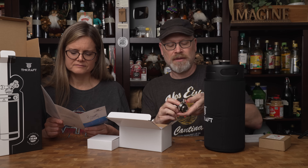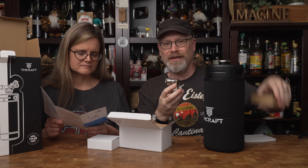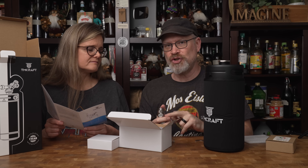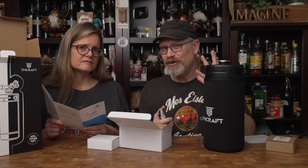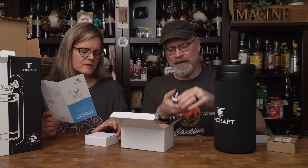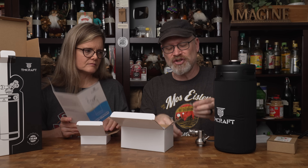This is the main central part. When you take this off, you screw this into here. The pressure regulator screws on here, and over here is the pressure release valve — that's really important. It is an automatic pressure release valve: if pressure gets too high, this will release it. It's not regulated to the gauge — this won't release before that will actually get forced past 30 PSI. It's more of a safety thing so that this doesn't explode. It's very heavy and feels very high quality, with an O-ring seal and a spring.